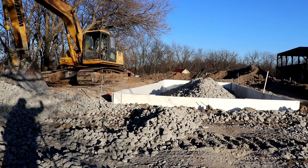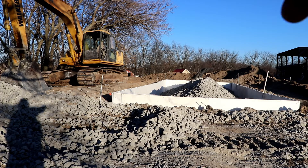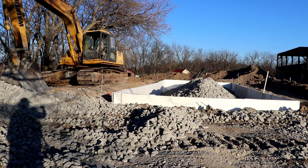After that is done, all of this is going to get covered up with two feet of soil. We've had some minor challenges, so I'm not going to stack the last two feet of foam directly on top. Instead, we'll put the soil on top first, mark the corners and outside edges of the styrofoam with little flags, and after we get two feet of level soil over the top, I'm going to rent a trencher, trench a hole just to the outside of the styrofoam two feet deep, put the styrofoam down in it, and then we're done.